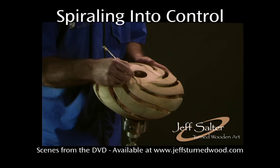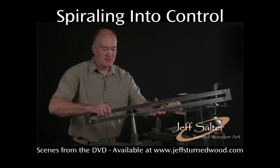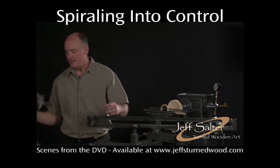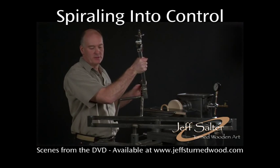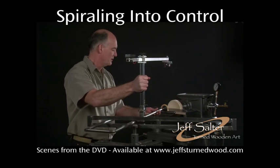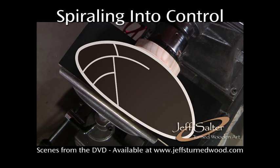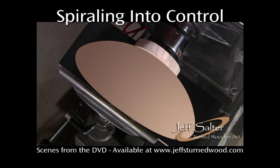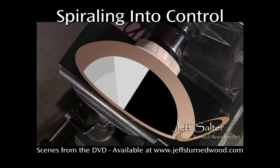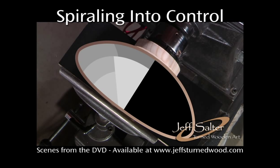Mark the initial rib for reference. The trap system is used — it consists of a secondary support gate, a D-handled tool holder, a boring bar, and a custom laser guidance system. The hollowing is performed in incremental steps so that the portion being hollowed is supported by solid material behind it. After the central zone is hollowed, each subsequent zone is brought to its final wall thickness before proceeding to the next.